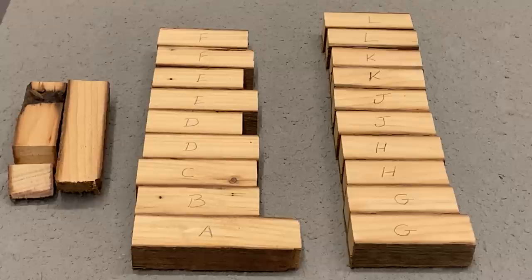Here's a quick shot of all of the blanks. At this point you might be thinking the next step is to drill the holes and get the tubes glued in — not quite. This was barn wood; it's been outside for well over a hundred years. This wood probably has a reasonable level of moisture in it, so we're going to document all of the wood, weigh each piece, put it in a toaster oven, and bake it for a while. We'll remove it, weigh it again, and continue to cook and weigh until the weight stops decreasing. Once the weight stabilizes, we know we've cooked all the moisture out, and then we'll be ready to drill and glue tubes.